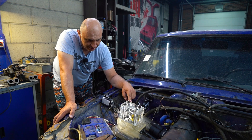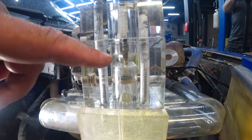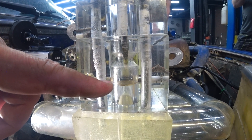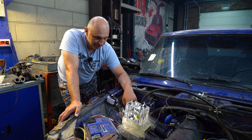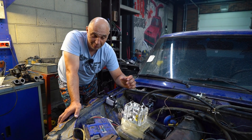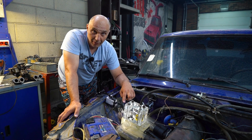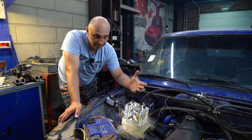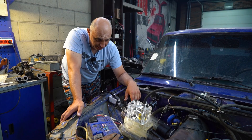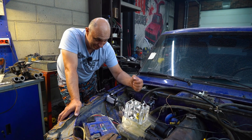The reason we are seeing such an effect is that this is a single barrel carburetor we've made. As you can see, you've got a wider diameter, then a taper, and then wider again. That creates a Bernoulli effect — in that spot, the air accelerates. We got an excellent view of how the mixture was flying through the carburetor at breakneck speed, going through there really fast into the manifold. Obviously there's a good amount of vacuum — with the pistons being 80 millimeters in diameter, factor in the stroke and that is going to create one hell of a vacuum. So the mixture was really moving, and importantly, we were able to watch it all happen.